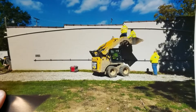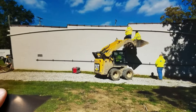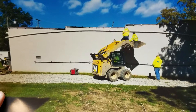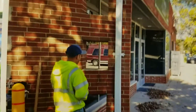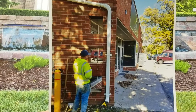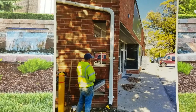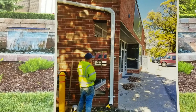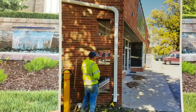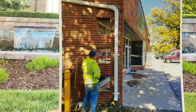The overflow pump — because it's like a bowl behind this building — actually lifts the water, and you can see the pipe we installed at the top of the building. It takes that water to a downspout, because since it's like a bowl in the back there's no other way to get the water out. Once we get it to the front, it runs down the shoulder of a road into a storm system.